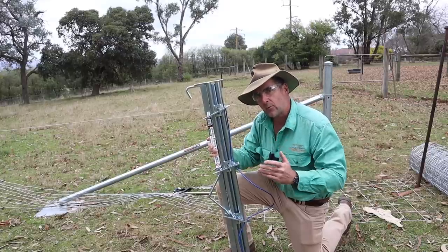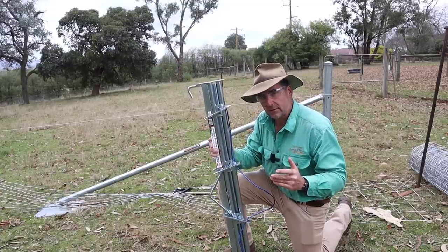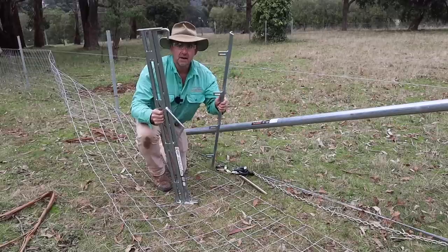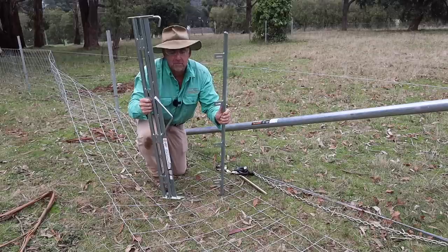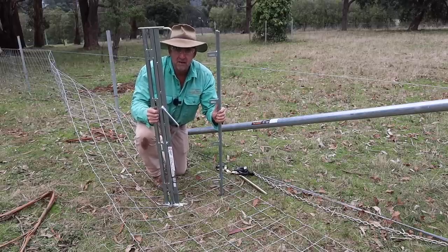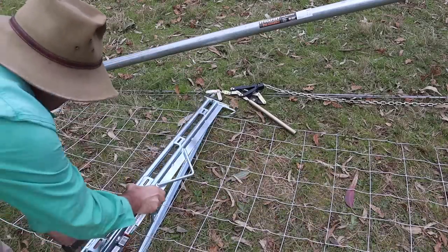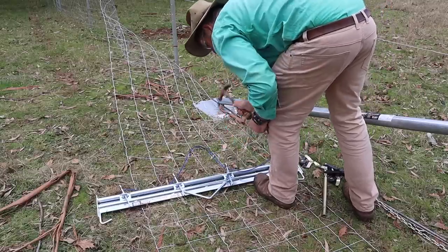Now I know that there are people who try and get away with a couple of pieces of timber and a few bolts. You'll get uneven results and quite frankly it's dangerous, and you'll never see me doing it on the channel. Get yourself a decent set of prefabricated mesh straining bars — they don't cost as much as you think and you will use them time and time again and get great results. Your prefabricated mesh straining bars come with two parts — the small part and the large part. You're going to want to put these on your prefab mesh a fair way down the run because this wire tends to take up quite a bit. I lay my strainers out connected to the end post first, and that gives me a guide as to where I should put my hooks for the straining bars. Now I'm going to put the small part underneath the mesh, large part on top, clamp them together with the sets of wedges, attach them to my strainers and away I go.